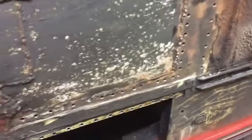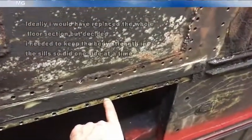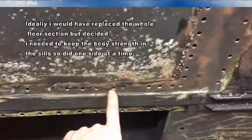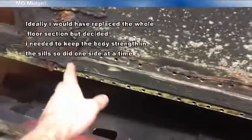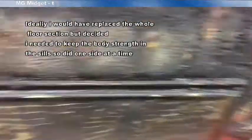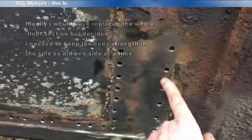At the bottom of the floor, I've made a start by wire brushing back the chassis to identify where all the spot welds are, then using an 8mm spot weld drill to drill them all out. I don't actually need to do more than that because all of the floor is going to be slit across the bottom and the cross member is going to be replaced as well, so I'm going to be cutting across here and everything else is going to go.